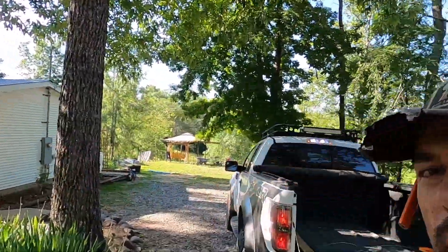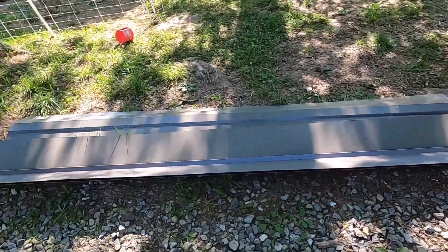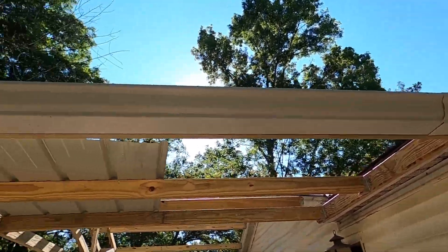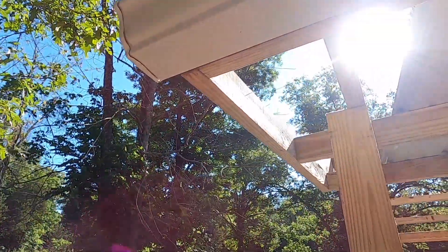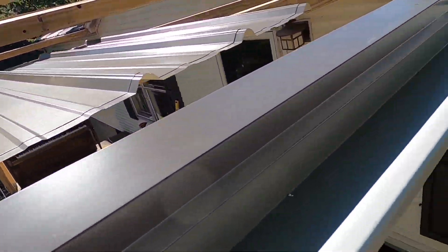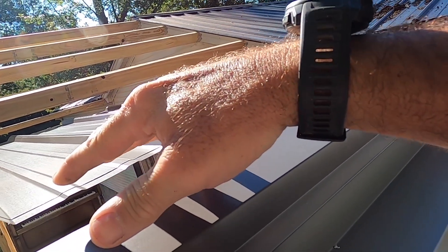Back at the porch job again. We've got our roofing steel, ridge cap, and valleys. The next thing I went and did was get my left-side gutter on, which meant getting that 90-degree corner in there. The gutter's on, the end cap is on, and I've also put the drip edge on — so the next part will be putting the roof on this section.